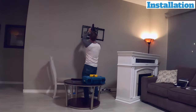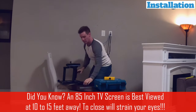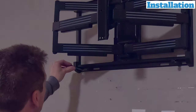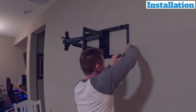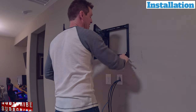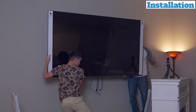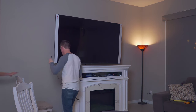With my trusty ratchet I removed all four bolts and took the mount off the wall. Next I used my stud finder to locate the studs, and a heads up — the drill bit should be slightly smaller than the bolt going into the stud. My GoPro battery died while drilling the first three holes, but basically you drill the top two holes, screw the bolts in loosely, then drill the bottom two and tighten all four completely. Then we hung the TV one more time, hopefully for the last time — it hangs right on the hook and we added the securing screw. Done!